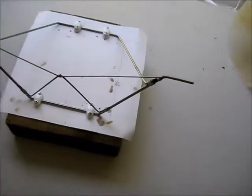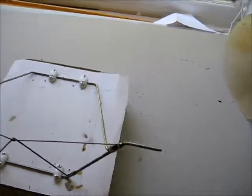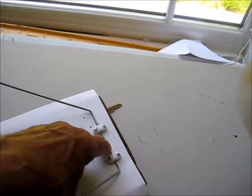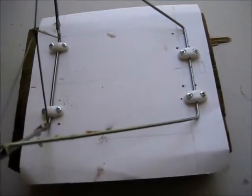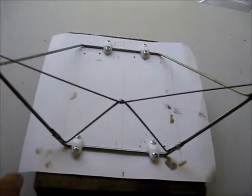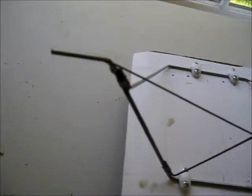The other job was the undercarriage. This was a bit tricky — I've not done soldering before so it was quite a challenge. What I did was mount the front section to a piece of wood, got the angle right at a slight angle, measured the distance to the fixing point for the front support, then offered it up and did the bends to make it match the main legs. A bit fiddly, but I wired it on, soldered it on, and then bent these pieces to shape and soldered those into position. It's not a brilliant job but I've not done it before.